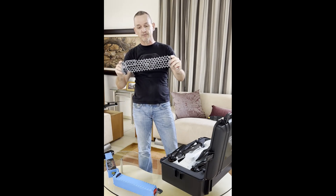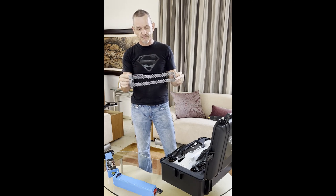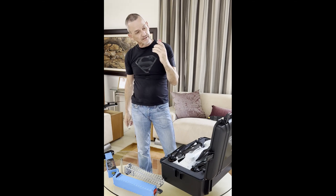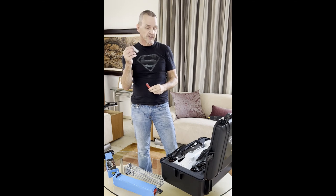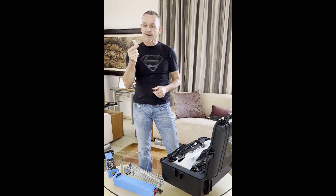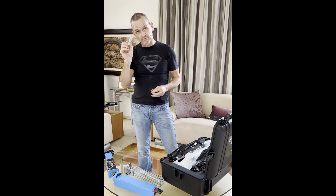Here's what the little frame looks like before the cells are put into it — the PC board and everything else is still missing, but this is the battery frame that holds them all in place. This is 17,500 milliamp hours at 50 amps. You can reduce the capacity down to 14,000 milliamp hours using 2,800 milliamp hour cells, but they can deliver a hell of a lot more power — up to 75 amps from the pack itself. So if you really want to carry an even heavier load, you switch to these cells.